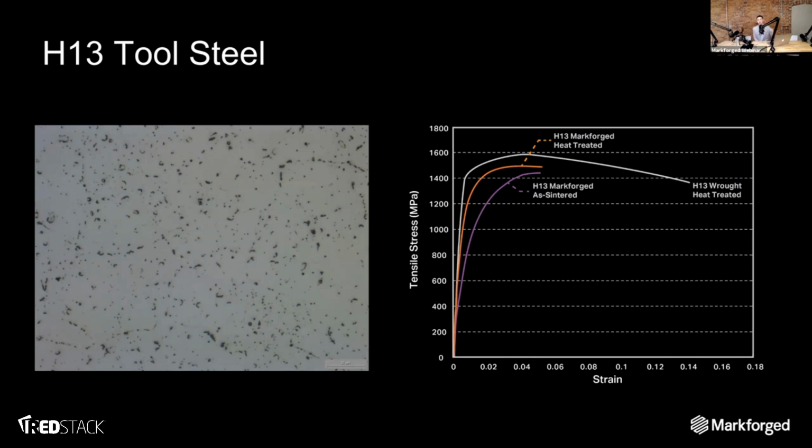Alternatively, if you temper it a little bit cooler, somewhere between 500 and 530 C, your Rockwell hardness will rise to in the neighborhood of 50. This is general metal, not specific to ours. And so you can get a little bit harder of a steel. What you get there is that the toughness of the material by, say, an Izod notched standard would drop significantly. So tempering it to a higher temperature gets you a lower hardness but higher toughness. So that's kind of just an overview of the space there. There's plenty of literature out there about tempering temperature versus toughness and hardness. If you want to use H13, and I'm sure you already do, you can look into it. Our stuff generally holds true to what those standards are.